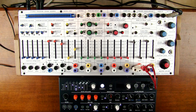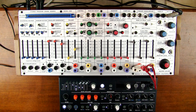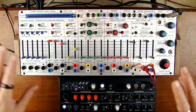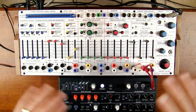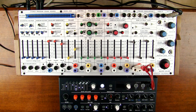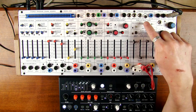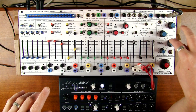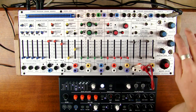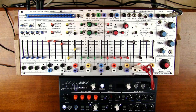Of course, if you want to, you don't even have to use a typical functionality to control the gates. You could use the random output or the sequencer or any number of things to control these, but we're just trying to give you a basic setup. So complex oscillator goes into gate one, modulation oscillator goes into gate two. You can control whether they are filter, whether they are amp, or both. Make sure your mod oscillator, your gate two source switch is in the center, so you're getting both of them sent independently to channel A and channel B volumes. Set those to what you'd like them to be and turn up your master volume. You should be able to create a sound.